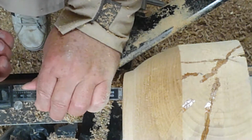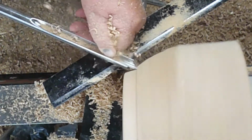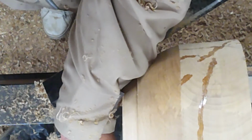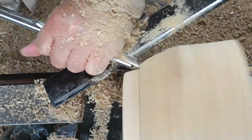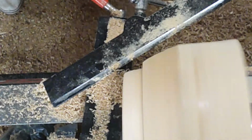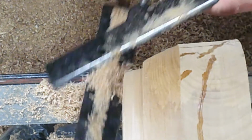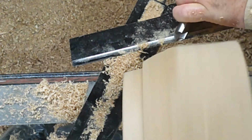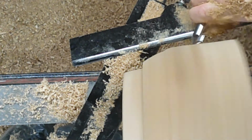You can see in this shot, I've gone in with my digital vernier calipers and I've measured the depth of that recess in the bottom. And what I want is for the foot on the outside to be the same depth or just slightly bigger, because as that bowl curves round and I take the feet away, I want the bottom of the bowl in the recess to be the same curve as the outside of my bowl that is there now. So that needs to be quite accurate.